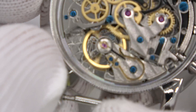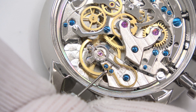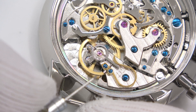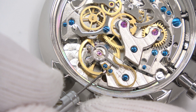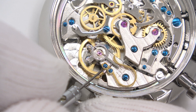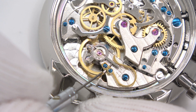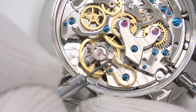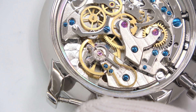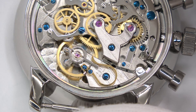So if I were to put the screwdriver in here — I did this before with a loupe and my face has to be literally right in it, so I'm not going to do it now — but you can get the screwdriver into this screw or stud. If you turned it clockwise, the screw is going to go through this tap here and push on this stud, slowing the movement down. And if you turn this screw counterclockwise, this swan's neck — like a spring — is going to press this stud and bring it closer to the positive side. So you say great, it's doing the same thing as before, just doing it with a screw — and you would be perfectly correct, except it's a screw, so it's acting like a jack.